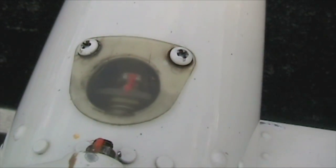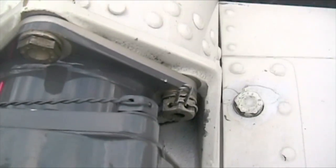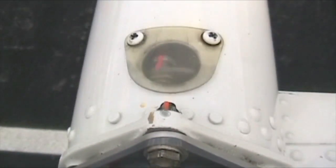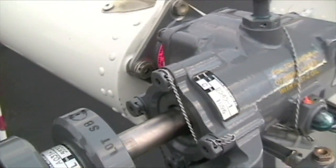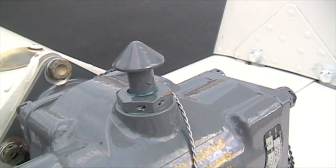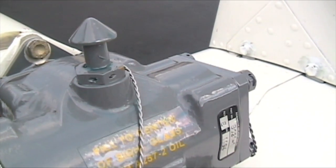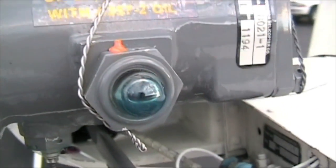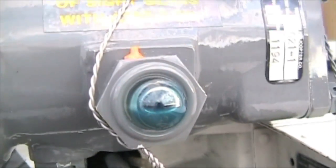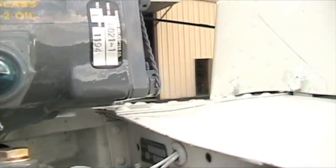This isn't on a pre-flight checklist — at least not from Robinson — but it's something good to do to make sure everything is tight. At the top of the tail rotor gearbox attachment point to the tail boom you've got safety wires on the attachment bolt. Safety wires are all over this. This is the filler slash breather tube hole where you can add gearbox fluid. Safety wire runs from the top down to the sight glass. Check the fluid level — it's right in the middle of the sight glass. Very good.